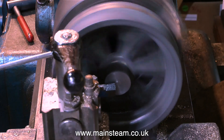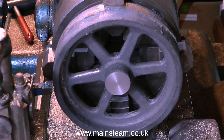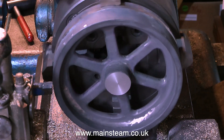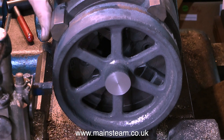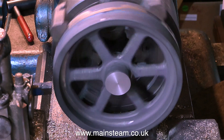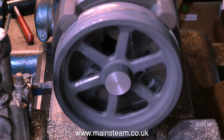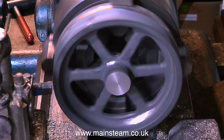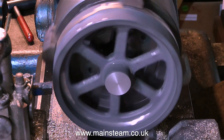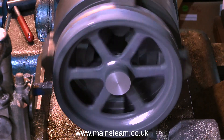If you're watching this clip very closely, you will have noticed that the lathe tool was near the edge of the flywheel before I started turning it. I'm double-checking, because having a lathe tool not touching the flywheel but very close to it tells me whether the flywheel's in the middle — it's a good reference point. Now I'm getting somewhere; this is running quite true, so I think I'm okay to start the cutting procedure. I very gently move the lathe tool in towards the casting, not to turn it particularly, but just to find out where the high points are. The tool is hardly touching the casting.